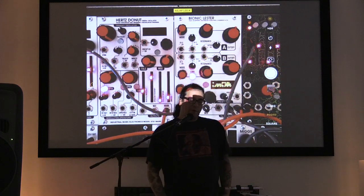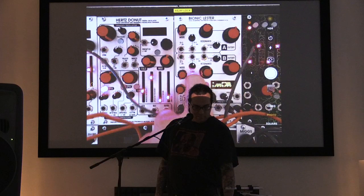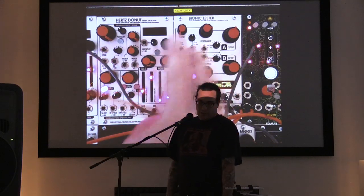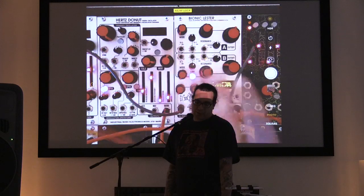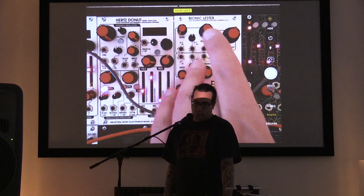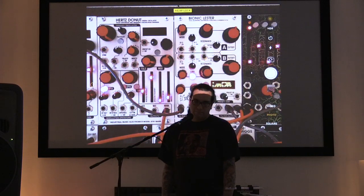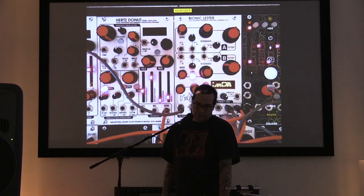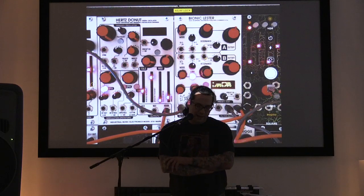The next filter mode is series. In the series mode, the control paths are completely independent. What you program with the CV inputs and your fingers on the knobs, one filter would not affect the behavior of the other. Instead, the output of filter A is digitally routed to the input of B, so you don't have to use a short patch cord to achieve series effects.